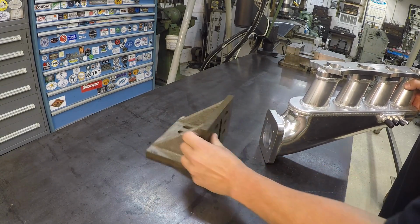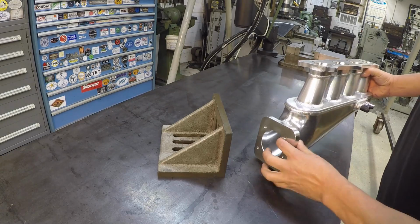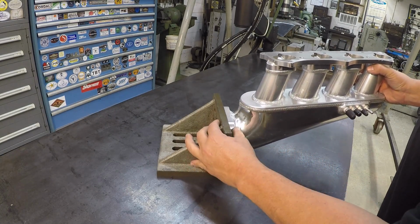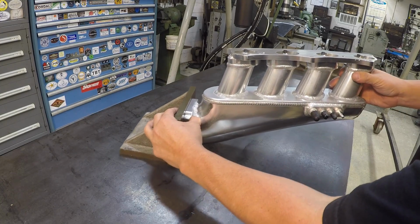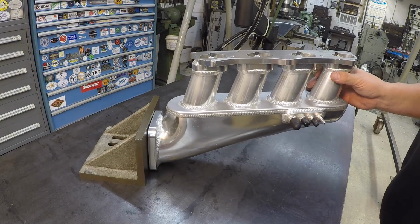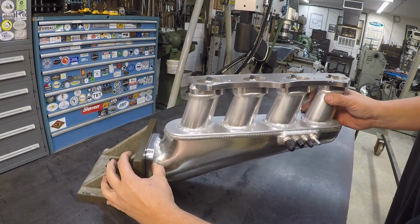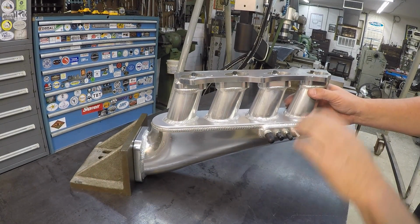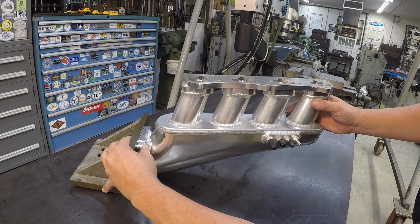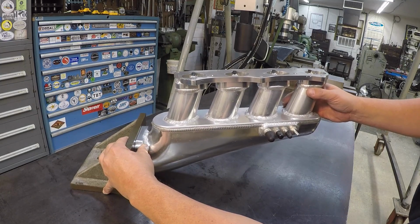This angle plate here will actually mount up to this hole pattern right there nicely. So we can mount this side right there in the angle plate, and then because of the angle, you can see the angle there where it's mounted up. This side's kicked up, so we need to tilt it so that this thing is nice and level, and get it indicated.